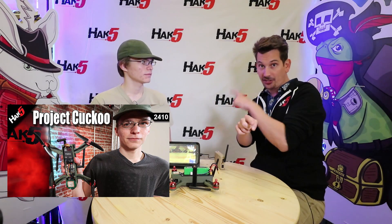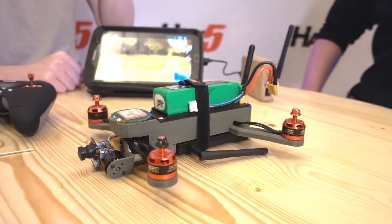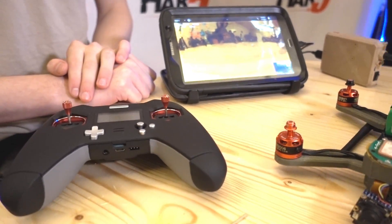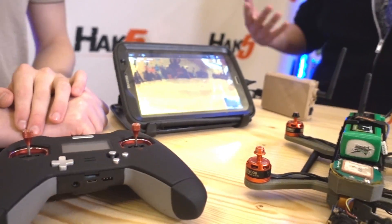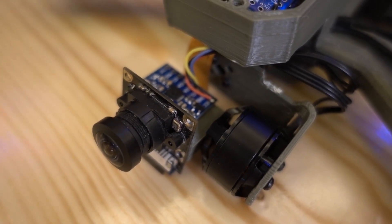Go and stop and watch that video if you haven't already seen it. What have been the upgrades since then? Last time I was using an analog video system that works, but I wanted something more capable. Normally you have a camera that goes directly to a video transmitter, and that gets plumbed back to a receiver on the ground — normally at 5.8 GHz. It's really limited in quality; effectively it's like 640 by 480. You get static readily, no forward error correction, no fancy stuff.